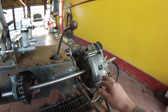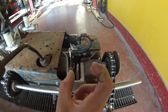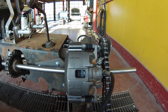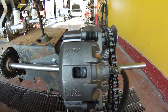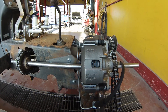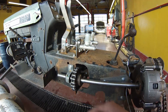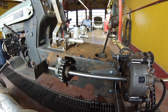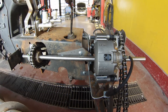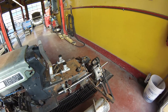The only thing I had to do with these calipers is, because the disc is so skinny - normally you'd have a vented caliper on a car - I did have to add some steel shims to the disc pad, you can see there, and that just allowed me to take up that extra space. When the left track is braking, it is going to have to be braking on this chain - hopefully that isn't too much pressure on the chain. All in all I think it's looking fairly good. I ran it up in the air and used it and it does spin the pods and stop one and spin the other.